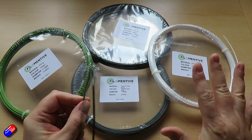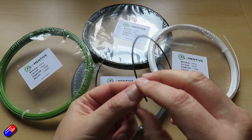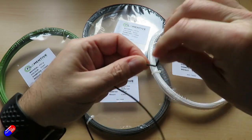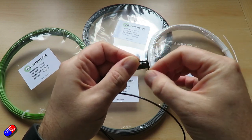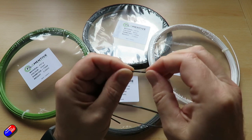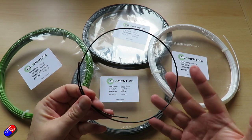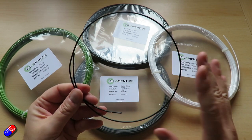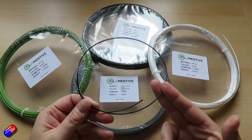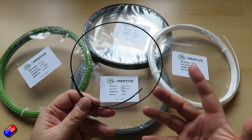The next plastic is probably my single most favourite for 3D printing: PETG. It's much tougher than PLA and super easy to print as well. You need about 240°C versus the 205°C for PLA, so your hot end needs to run a little hotter, and ideally you want a warmed print bed — it helps with adhesion; I only run mine at about 40–50°C. It's a really, really nice plastic to print with, and it has very low fumes — it doesn't really smell of anything. Always use extraction when 3D printing, but this one doesn't give off any particular smell.